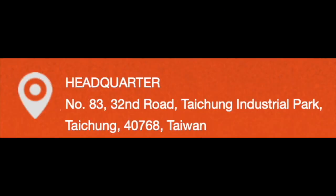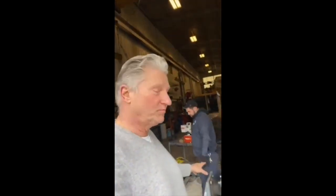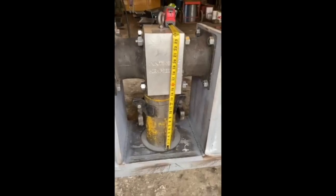We're about to test these Everpad elastomers — we purchased them from ICE Seattle — just to make sure that we had the right elastomer. You can see on the side it says 'Everpads.' Everpads is an elastomer manufacturer from Taiwan. Everpads does not publish the spring rate of their elastomers, so the only way to figure it out is to actually do this kind of test. We're about ready to test these two elastomers; they're in place on a special test stand that we've made.